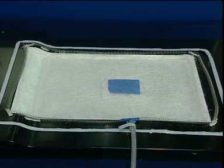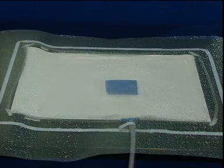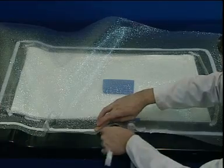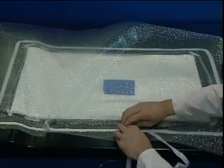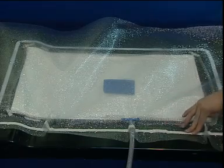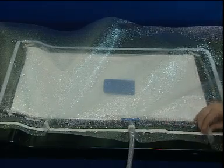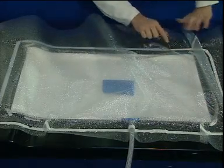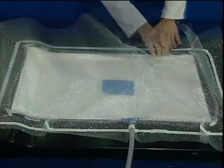The key to vacuum injection is a textured film, which allows excellent resin distribution with no additional layers over the laminate. The molder should ensure that there is enough film to take the shape of the molding — up to 50% more film than molding area may be required. The film is sealed carefully using the tape, and pleats are used to ensure that there is no bridging of the film.